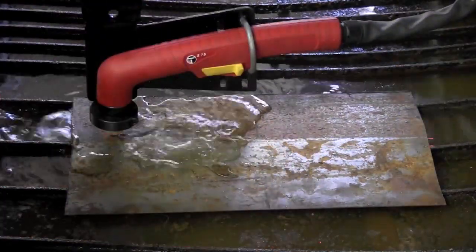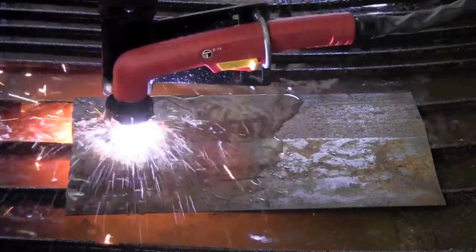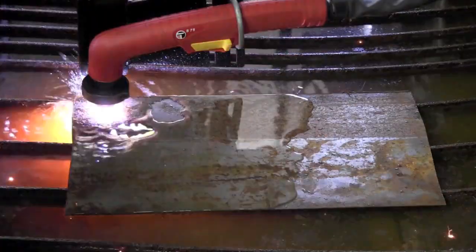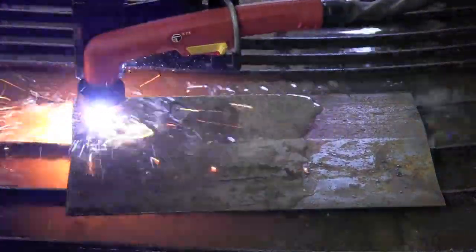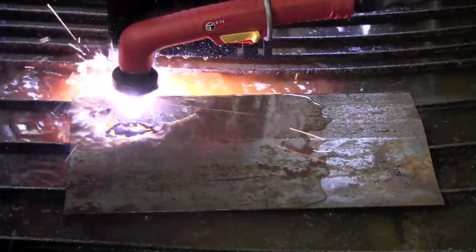This is the first test run of this machine and I did have it turned up to the full 60 amps. Basically what I would do now is for the next couple that I cut out, I would start at 20 amps and see what that did. I'm about maxed out on my machine for travel, so turning the amps down will help with the dross on the back side.